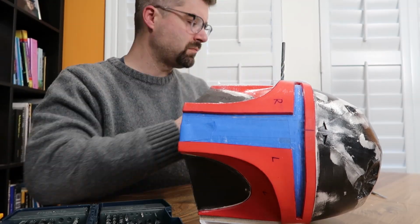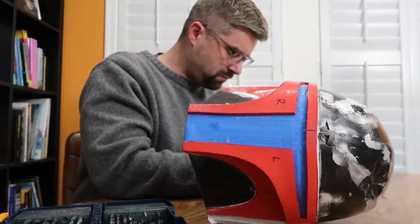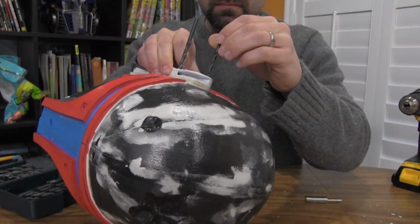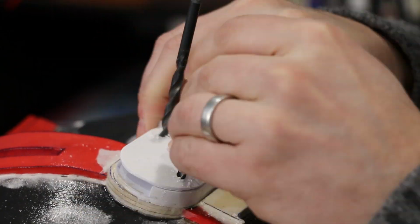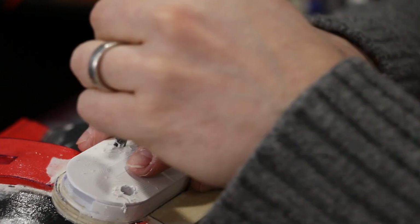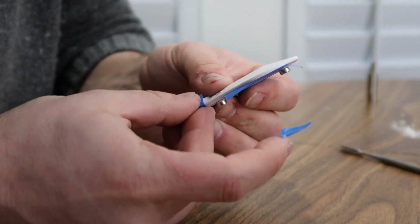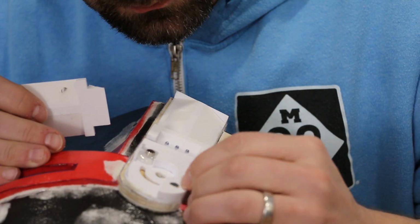With 2 holes to drill and a level of precision needed so both sets of magnets lined up perfectly, I drilled a hole all the way through both of them and started the second hole, with the first drill bit staying in the first hole, so nothing moved around. From there, I increased the size of the holes with a drill bit in whichever hole I wasn't widening at the time, so everything stayed lined up. This takes a little while, but I only had to do it once, and compared to other steps in the process, this step would have taken a lot longer to fix if I hadn't done it well the first time.